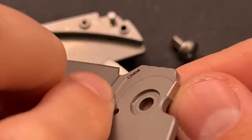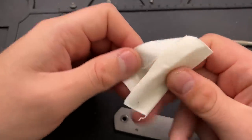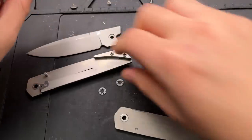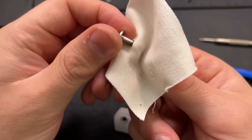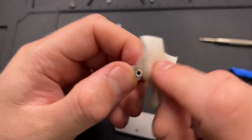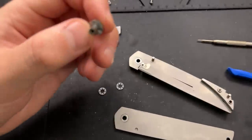We do see that they did break this little edge, providing a little bit of a detent ramp. I'm using rubbing alcohol on a Q-tip to clean things up. I'm taking the bearings and running them in the fabric with alcohol to clean off any residual gunk. I want to clean off the pivot as well. It looks like the pivot got overheated — what it looks like is they ground down the pivot, shortened it mechanically, so the very top part got overheated. It shouldn't actually have an effect, but it sure does look like they ground it off, like on a belt grinder.